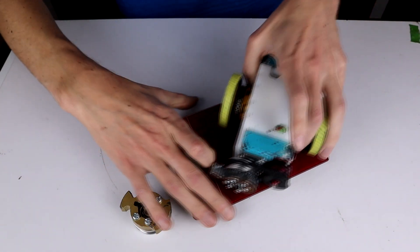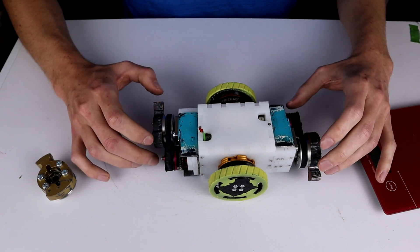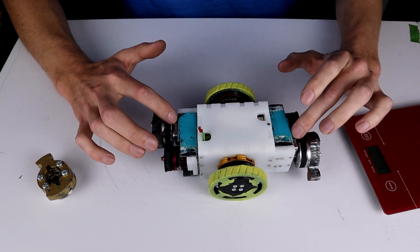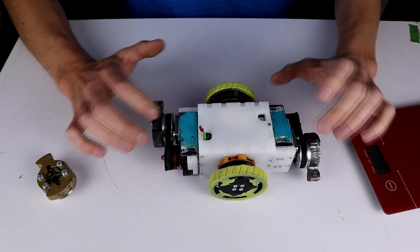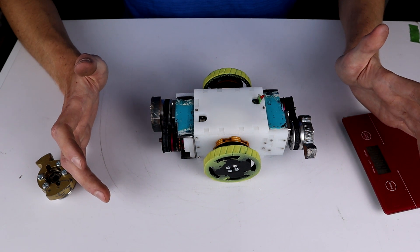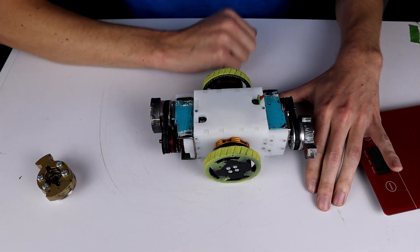Everything is actually ready to rock and roll on this melty. There's about another hour's worth of work to get this fully fight-fit, but we'll do that over the next couple of days while traveling. These new tool steel posts and metal outers are going to give a ton more rigidity to the weapon system, so I don't think we'll see the same issue we saw at ARC's Havoc at NHRL. That's going to be exciting — that's it for this video, I hope you enjoyed it and I'll see you in the next one.